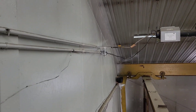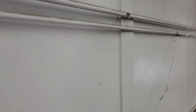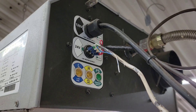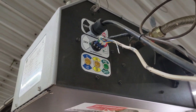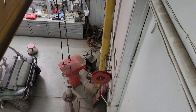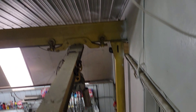I got the thermostat wire off the wall and I'm stretching it along over to this other heater here. I'm just zip tying it to the electrical conduit rather than stapling it to the wood. It looks like it's going to be just about the right length to get to our heater. Seems like that was too easy. I just cut the ends off and crimped the new ones on with two wires in it and put them back on there. I think we're good — I'll go down and kick the thermostat up a little hotter and see if they both turn on or not.